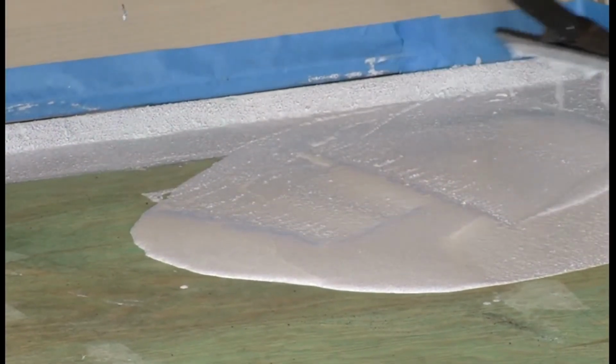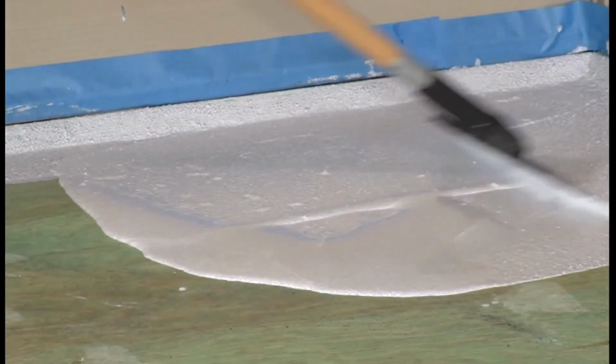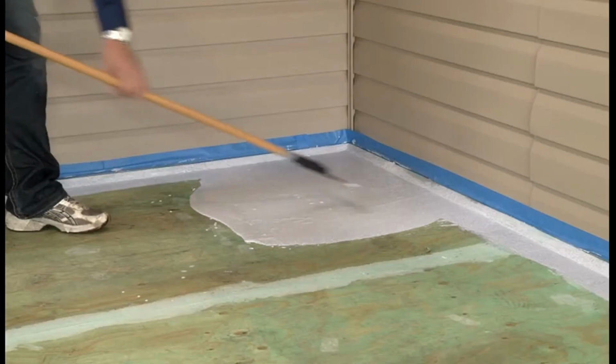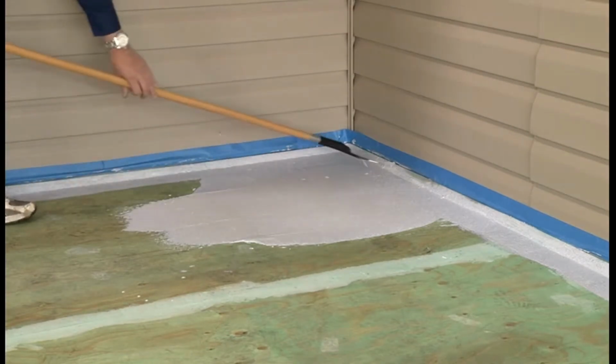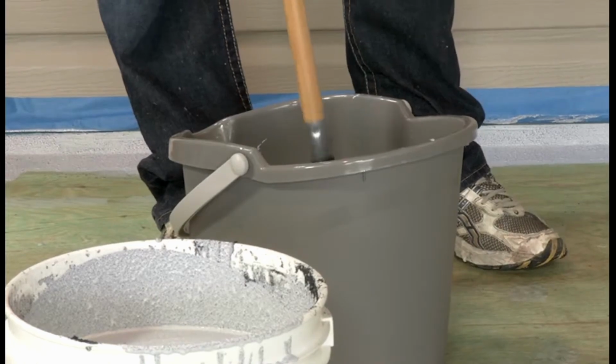Using very light, consistent pressure, spread the puddle, moving the blade to evenly disperse the product. Spread the Roll-Tex in a consistent way using a left and right motion and pulling it towards you. On your last few passes, pull the blade down across the bare plywood to get the excess product off the blade. This helps keep the product from dripping from the applicator as you lift it to do another pass.